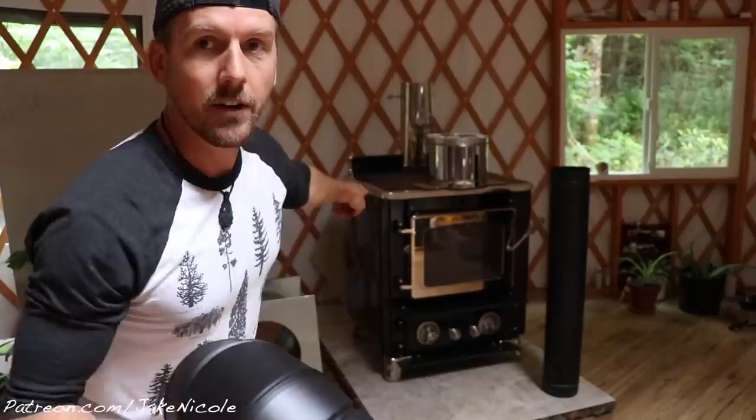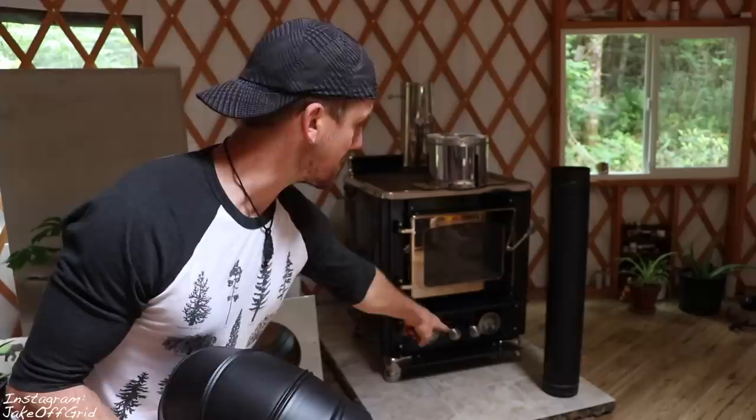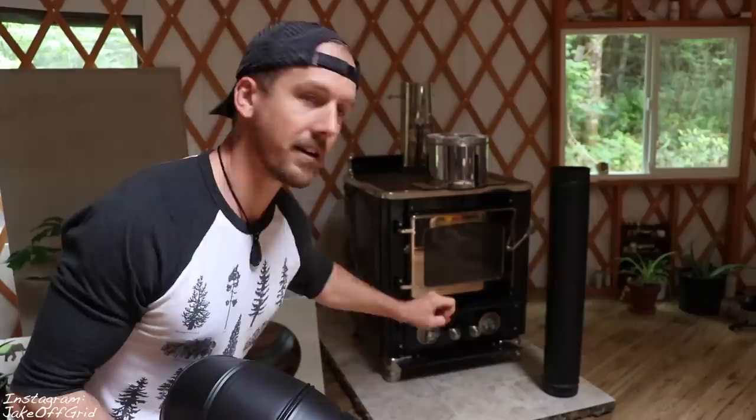And we've got at least 2 feet of space between the back of the stove and the wall. We've also got the tile and the block, three layers. We have hardy backer, we have block, then we have tile. So the floor there is super thick and will protect the platform and the laminate floor from getting hot. And there's at least 2 feet of space in front of the stove so that any sparks that come out of the stove won't catch wood on fire, it'll land on the tile.